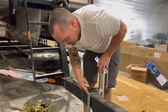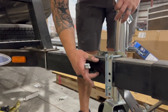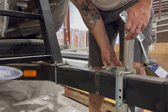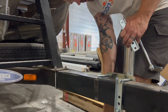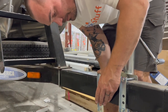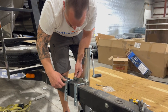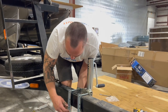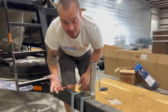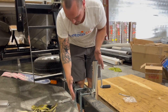Every trailer is different. We use that top hole and the third hole down on this bracket. If your trailer is a little bit thinner or wider, you might use a different hole. I'm going to repeat this same process on the other side by putting my bolts through first and then getting that bracket in place. We put the jack in the same place that the old jack was — it was just getting old. Maybe somebody left it down when they took off to trailer their boat. But it needed to be replaced. The position was just fine, so we kept it just about the same spot.